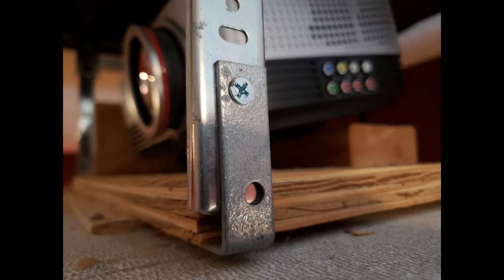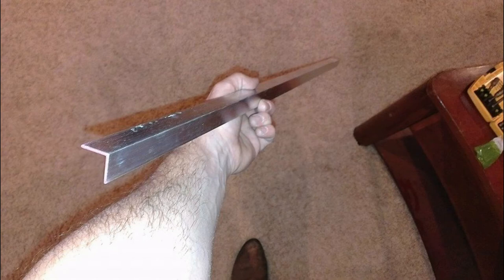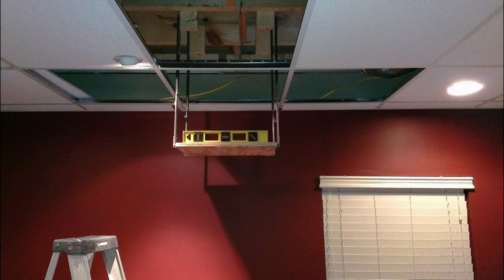To stabilize the base and drawer slides, I attached L-channel aluminum to the two left and two right sides. This way the slides must go up in unison and one cannot go faster than the other, causing the lift to tilt forward or backwards. I measured the distance from the slides front to back and cut the L-channel to fit. I then found a hole on each slide I wanted to put a machine screw through with a nut on the back, drilled a hole to accommodate the machine screws, and attached the L-channel to the slides.